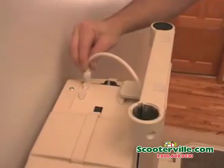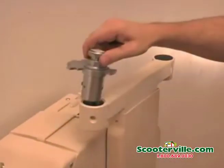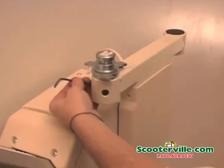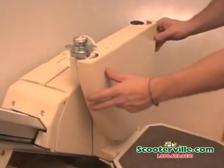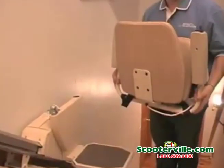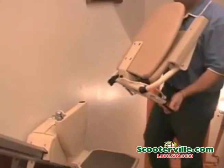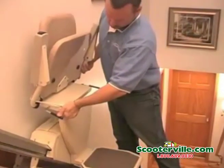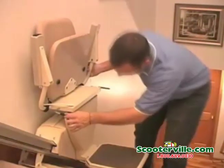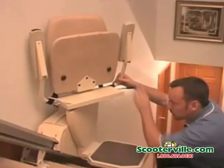Connect the footrest cable to the six-pin connector on the chassis. Position the keyed seat swivel post in the hole in the seat base closest to the top of the stairs. Securely tighten two bolts using the 5/32 inch Allen wrench. Use the white plastic plug supplied to secure the vertical footrest shroud and the main footrest cover plate. Position the seat assembly on the seat swivel post, making sure the swivel lever is depressed so the seat is fully engaged. Check the swivel lever to test the locking mechanism — the system will not function if proper engagement is not achieved.